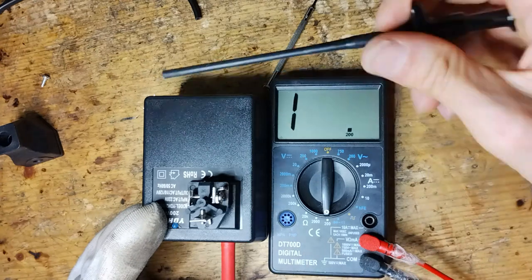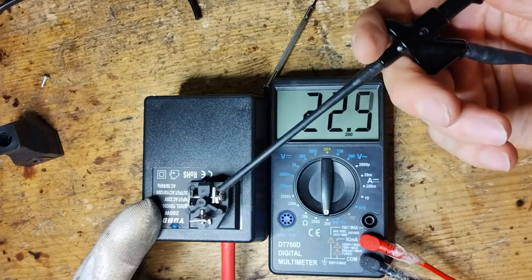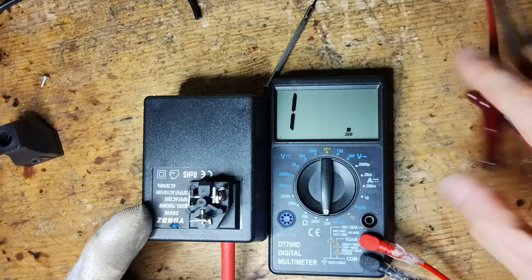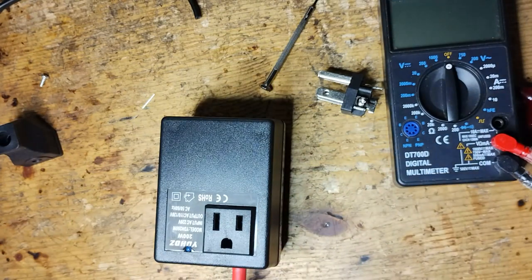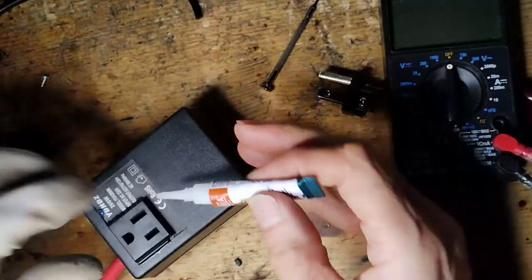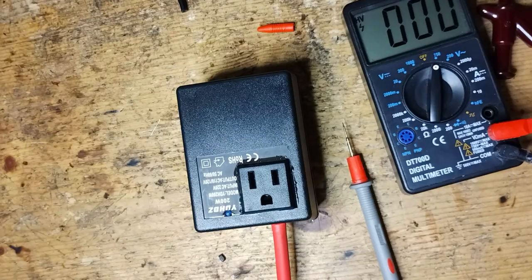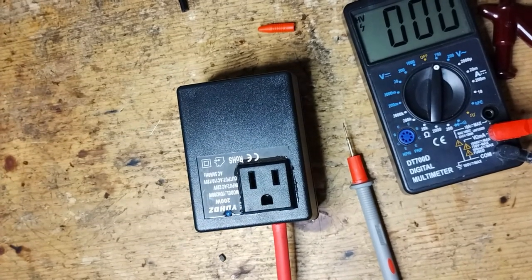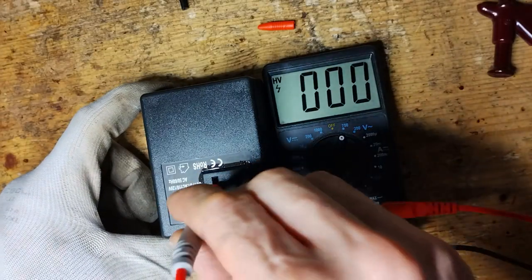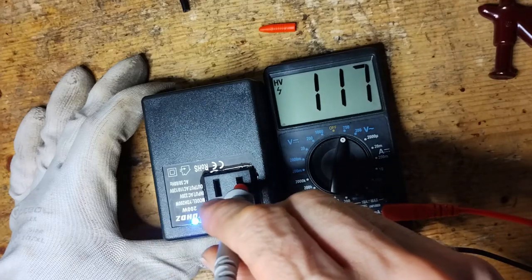A preliminary test is made measuring the resistance between the inputs and the outputs. The output socket seems to be too loose, therefore some super glue is applied. Then, the output voltage is measured between the outputs and the ground. When the power plug is inserted with the correct orientation, the LED remains dark and only one output terminal on the socket is elevated compared to ground.